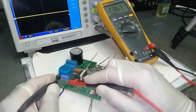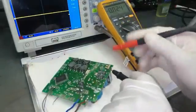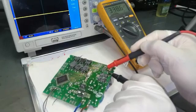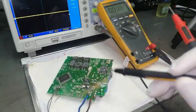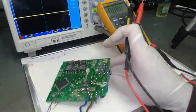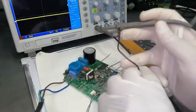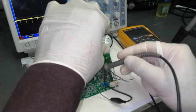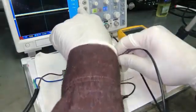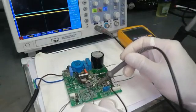I have 236 volts at the input. Selecting DC — we have 338 volt DC at the capacitor. From the TNY switch there is a drive to the transformer. After the transformer, I have output voltages.